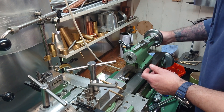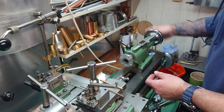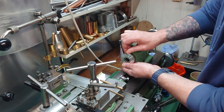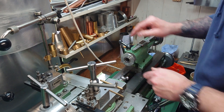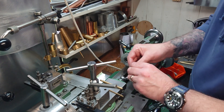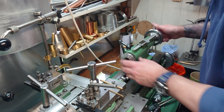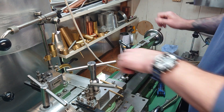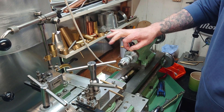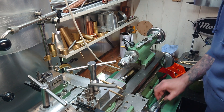And that's it, hopefully. So we're in and out, no problem, nice and smooth. But now there's no slop on there - just a very slight amount, or a lot less than there was. So next time I make one, when this brass one eventually wears out, I'll make one out of stainless steel and that'll probably wear a little bit better. But for now this brass one seems to be doing the job - it's taking a hell of a lot more of the slop out that was already in there. So if you've got a sloppy barrel and you want to tighten it up, that could be a solution for you - quick half an hour to an hour job.